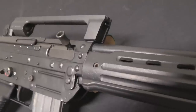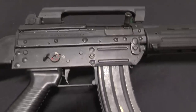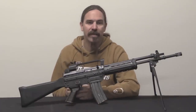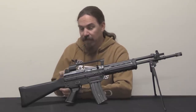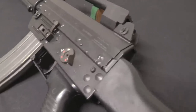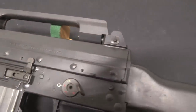In 1970, NATO decided it needed to standardize on a new cartridge. The US was by that point equipping its forces in Europe with M16 rifles in 5.56, while the NATO standard cartridge was 7.62 — this wasn't going to work. It took NATO a full 10 years to finalize testing and standardize on 5.56 — not the American 5.56, but the Belgian SS-109, adopted by the US as M855. This created problems for several countries including the US and Italy, primarily because that new standardized cartridge was a 62-grain bullet requiring a 1-in-7 or 1-in-9 twist to properly stabilize. The AR-70 and original M16s used 1-in-12 inch twist barrels, which didn't adequately stabilize the new ammunition — they were designed for 55-grain ammunition. Both countries would have to retrofit their guns or develop new rifles.